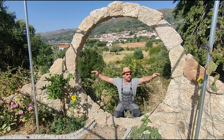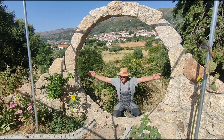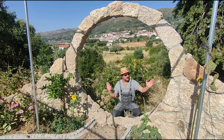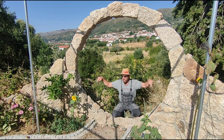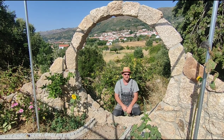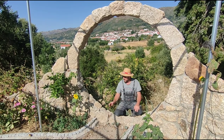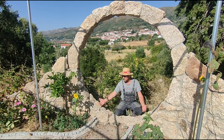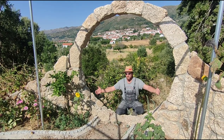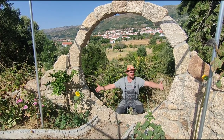half a circle, which was 2 meters across. And I then set the formwork in here to the angle, because it's on a curved wall as well, so it was a bit tricky to get everything in the right sort of place, but we got there in the end. Basically then you build your stones or your wall up against the formwork, following the circle shape, obviously.